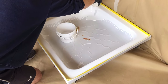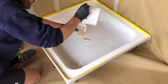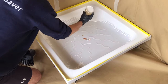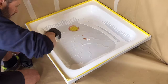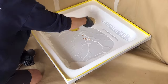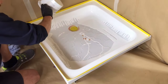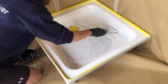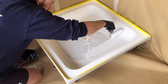The material will find its own level and cover everything to a beautiful finish. Pour the rest of the material into the cup and apply it to the base and any sides still uncovered. You don't have to be super precise — it's an easy material to work with. As long as you get it on nice and thick, take the roller from the kit and use it just to move the material around to cover any bald spots, then let the material self-level.